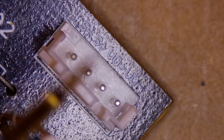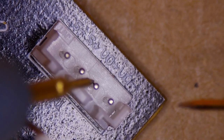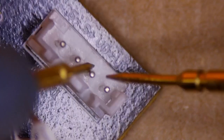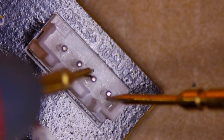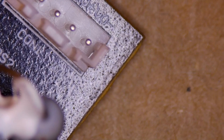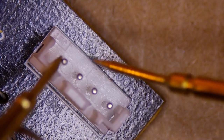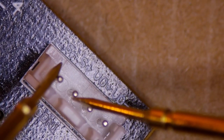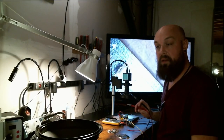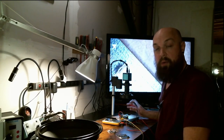You can't see my meter unfortunately, so you're going to have to trust me. We have our positive here — plug into that — and then plug into minus. I have exactly zero volts. So it does not look like voltage is passing on that voltage rail. Let's just check the S pins just in case. One there, one there — nothing. Zero volts. So it would appear that we have no voltage at all coming out of this board, which is unfortunate.